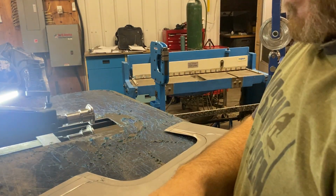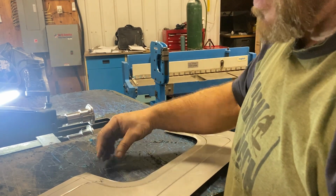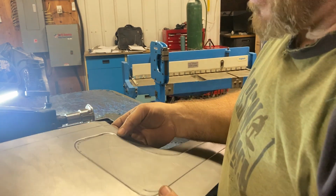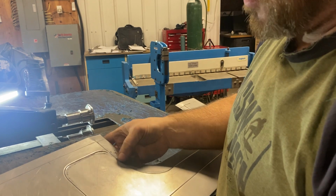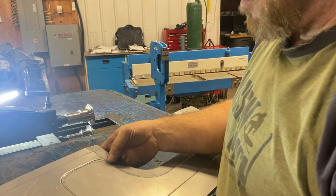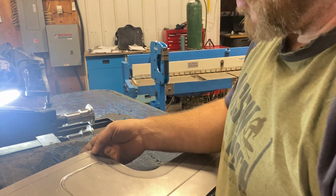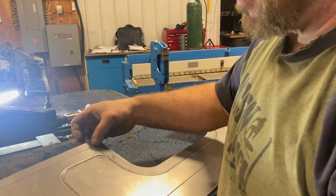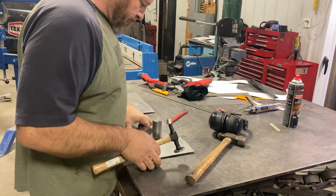So I have a step coming down, and then this is quite a bit lighter than this. This is a big step down because hopefully our next panel we're going to be able to mold into this. But these edges right here are a mess because of the two overlapping. I could have used a poly wheel on it, but this is very easy for me to clean up with a chisel. And as well, this edge is getting bent, so this line right here, we can easily correct that. So this is going to be the panel that goes below the column.